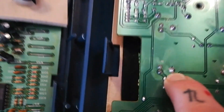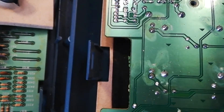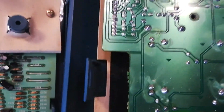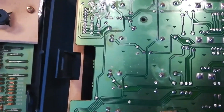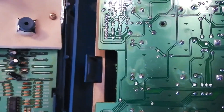What I'd be looking for is a sort of thin line, and then if you reached underneath and it's pressed against the component, you could actually see a physical break. That would occur where someone put too much pressure onto the component when they were using the fader or something.